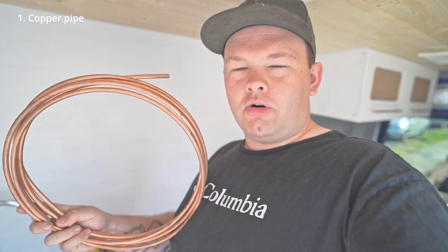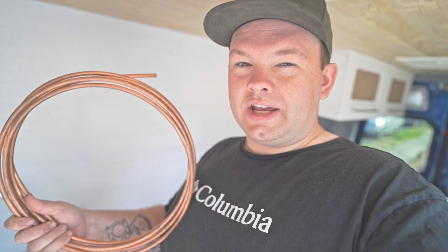There are several criteria that you've got to fulfil when doing a gas installation on a camper van. The first thing is that all of the plumbing in the van outside of the sealed gas locker has to be in copper pipe. I use 8mm copper pipe — it's called micro bore, but it's 8mm copper pipe. It's pretty flexible for getting around lots of awkward angles in a camper van, and it handles the pressure of the propane bottle really well.